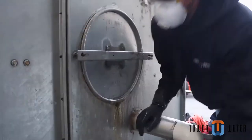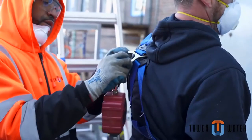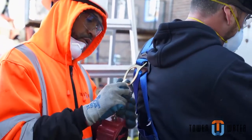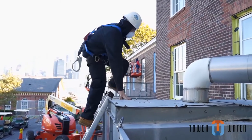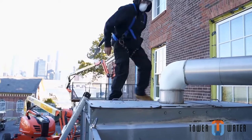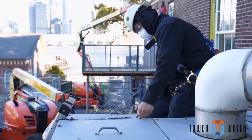After an hour and your final test is completed, open the drain so that the basin and sidewalls are exposed. Before going to the top of the cooling tower to inspect it, put the rest of your PPE on, including your safety harness and fall protection. When climbing a ladder, be sure the ladder is secure and properly footed.